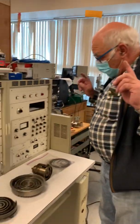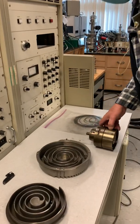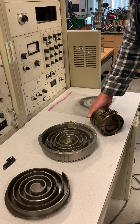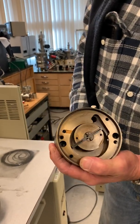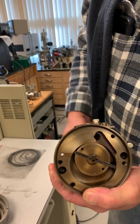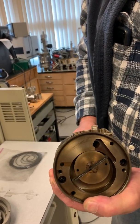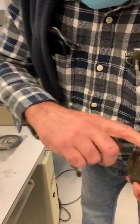In the early days this was done with leather bellows, and that's how J.J. Thompson did it in 1912 to make his first vacuum pump. It always helps to know a little history. This is a rotary oil pump — if I turn this, you can see how the volume changes in that chamber. Some models have a spring to push the vanes out; others work by centrifugal force.